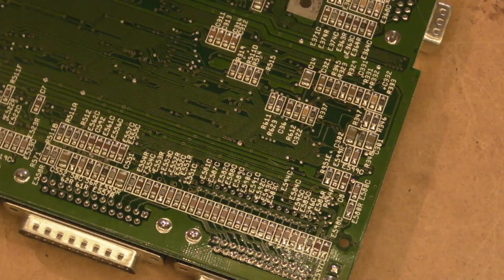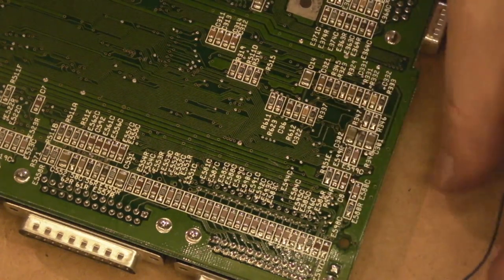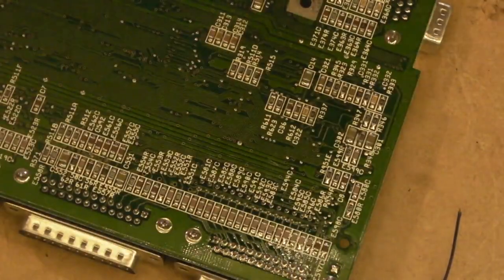I've got two pieces of wire here. These are what we're going to solder onto the bottom of the board. I'll do them nice and long and cut them down to length afterwards. I've tinned one up already, so I'll just tin up the other one — let's tin this wire up and then we're ready to connect them into position.